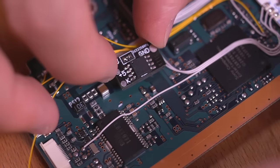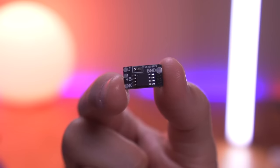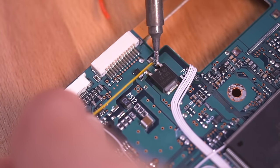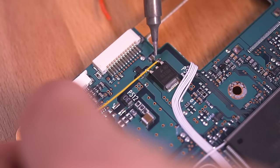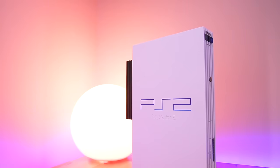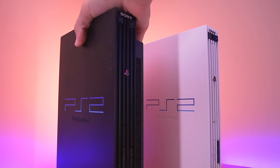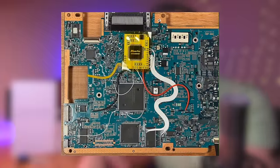When I was installing the Mars Pro chip, I actually thought it would be a good time to install another mod while everything was disassembled — I'll be going over that mod in another video. But long story short, I soldered a wire to the wrong leg on a voltage regulator, which most likely fried something, causing the DVD drive to not function. So I did what any sane person would do and modded another PS2 — this time a V9 motherboard as opposed to the V10 that I did initially.